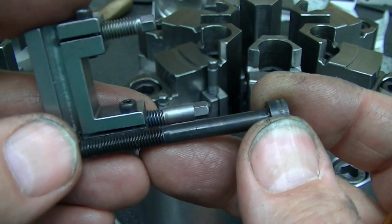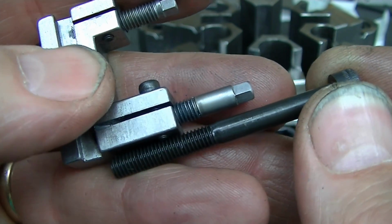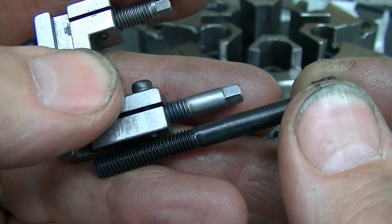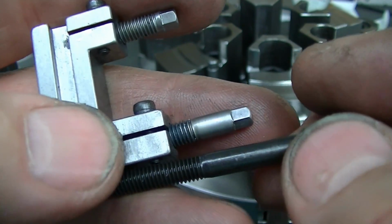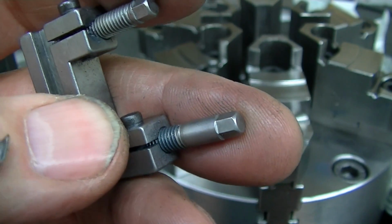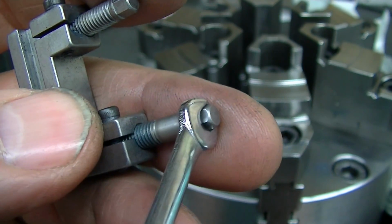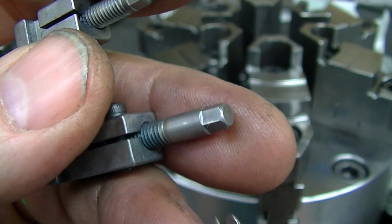So I look for a way to get the adjuster screw that I'm after, and here I say, okay, I use an M5 socket head cap screw, and that way I can get the threaded section versus the cylindrical section, whatever lengths I want out of this, just by whacking off the screw where I'm after. And the other design decision is, okay, what size hex can I put here that will get me out to the sharps? It turns out that 4 millimeters works out nicely.